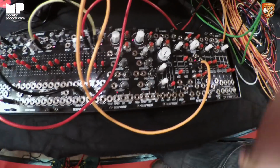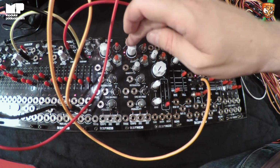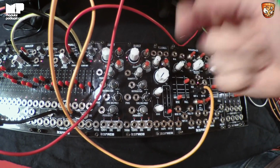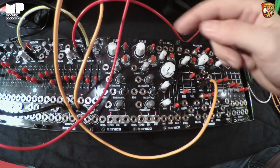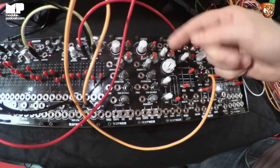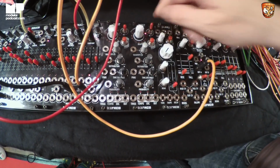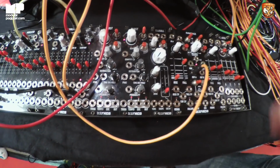Is that controlling the way the triggers are spread out? It's a burst generator, so you have a tap tempo. With this tap tempo, you generate a time window where you put your burst inside. You can divide or multiply this time window by a factor, and then you have some distribution of the triggers inside the burst, so whether they are more together in the beginning, or linearly distributed, or this kind of stuff. You have some probability, so when they are in a loop, sometimes it's working, and sometimes not.